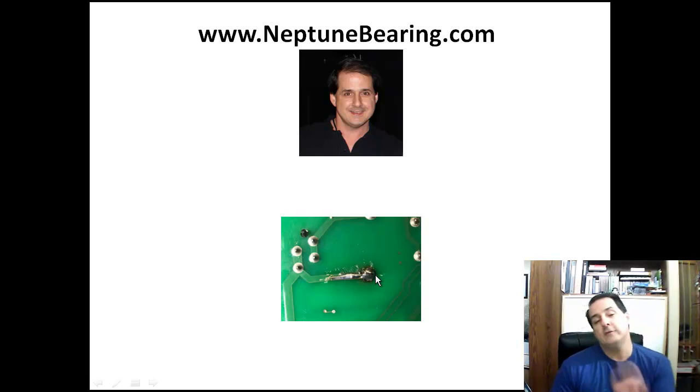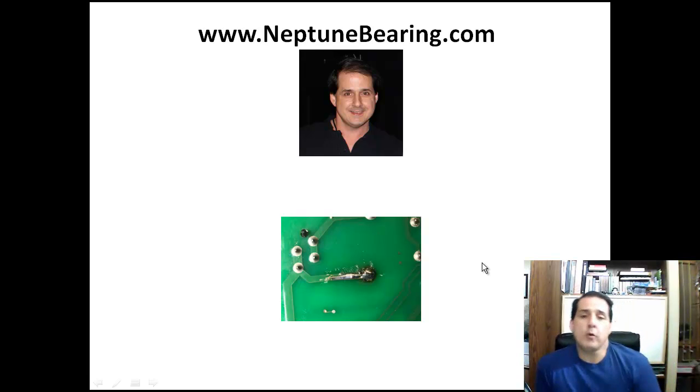That's why I'm thinking if you catch it early, you don't have to worry about it, because it just goes right to this connector right here. There are 2 connectors right next to the relay. So here are the 4 connections on the relay. There are 4 posts that come through. So you can repair your F01 board by replacing that relay. And if you've got the splatter on the back, that's what it is.